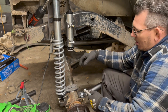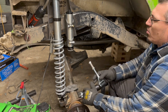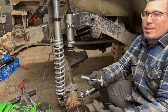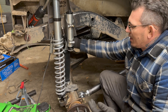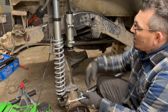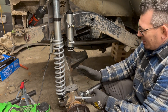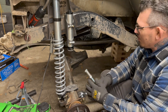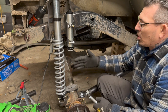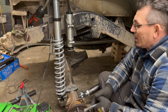The other thing I'm doing a little differently is I found a company that offers a link clamp for your limit strap — I ordered that and I think it's going to be here tomorrow. For right now I'm just going to worry about getting these mounts done. My plan is to mount it here pointing straight at my lower link. Originally I was debating doing it right inside here, but I was worried about adjustability on the clevis mount given where everything is situated, and also clearance issues with the coilover or the axle. I also didn't like how far inboard it was going to end up. This gets it out toward the outside edge — I always like trying to keep my limit straps in line with my coilovers, because it gives me a little more control. When you go to the inside you start losing that control.